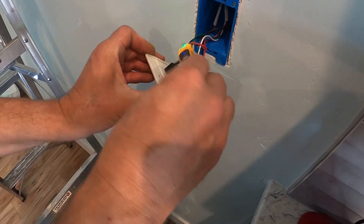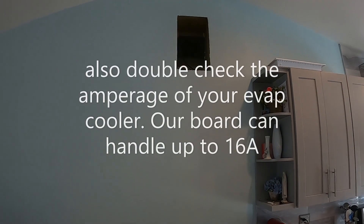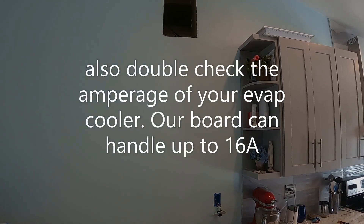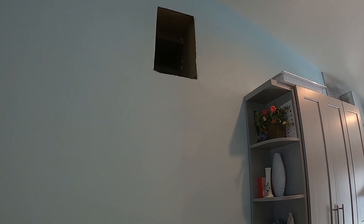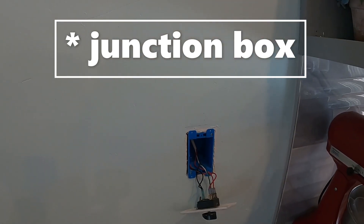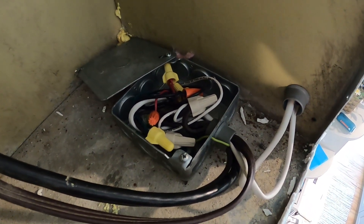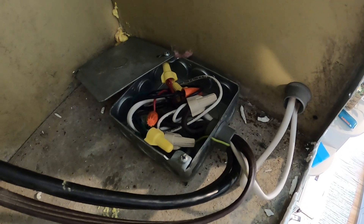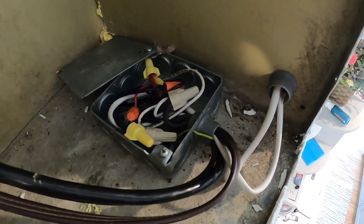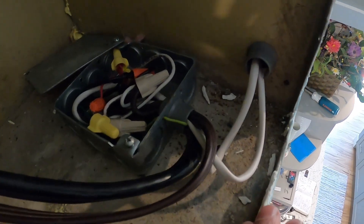In the planning stage, you want to think about how you're going to run the cable. Most likely you'll install the board somewhere in the cavity up there and run the thermostat cable down to where we'll install the new thermostat. The electrician had already installed a junction box, so we'll just replace it with our new enclosure and reuse the existing cables.